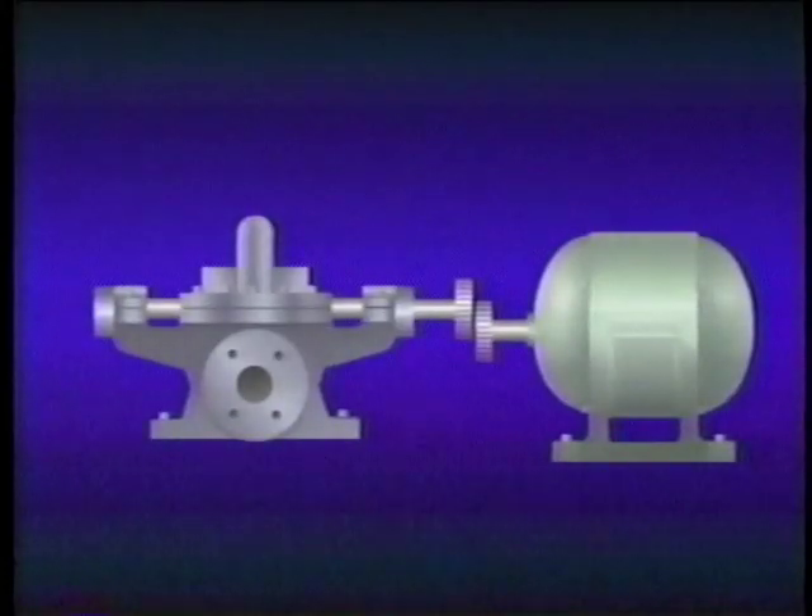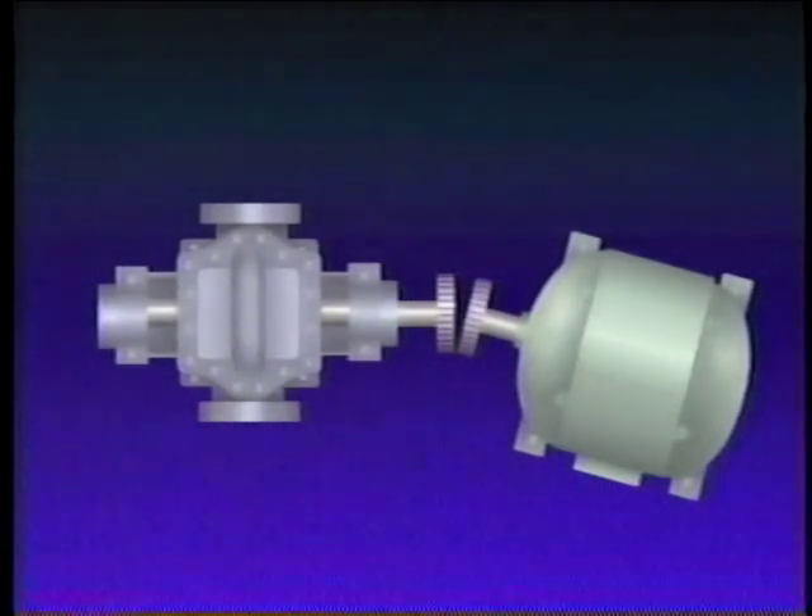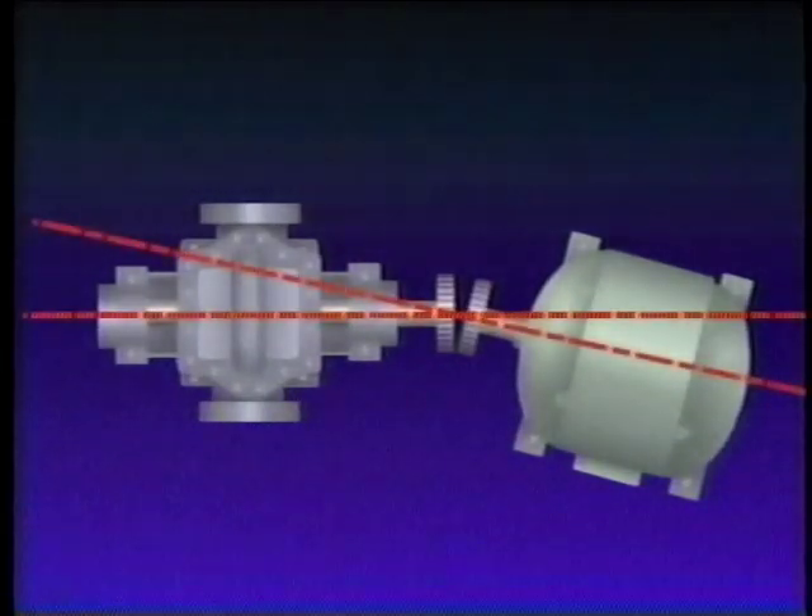To see combined misalignment, we'll have to look at the situation from two different views. Here, looking at the shafts from the side, we see misalignment in the vertical plane. When we extend the center lines, the shafts are parallel misaligned, but there is no angular misalignment. Since we can't determine if there's any misalignment in the horizontal plane from this view, let's look at the same situation from a top view. From this view, we can look at misalignment in the horizontal plane. When we extend the center lines of the shafts, we find that they are angular misaligned. Notice that it is impossible to see the misalignment in the vertical plane from this view. So even though there are two primary types of shaft misalignment — parallel and angular — they can occur in the vertical or horizontal plane, or in both, and you'll have to look at both planes to determine the actual misalignment.